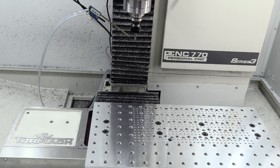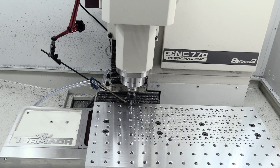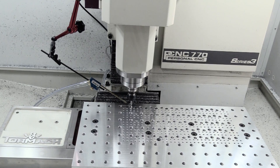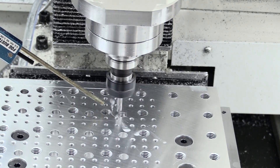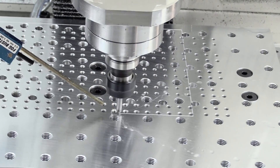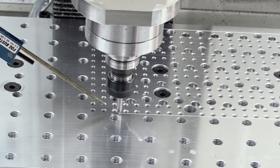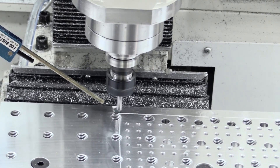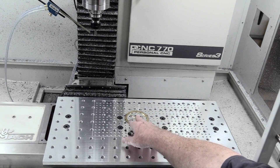The last thing I'm going to do now is engrave a rectangle around the work envelope of the machine. I have the machine at its maximum boundaries right now. What this will do for me is I'll always know when I'm mounting a part to the table whether the machine can reach it, which is a nice touch. I should have thought of this many fixture plates ago. And as you can see, I know I can reach that part.